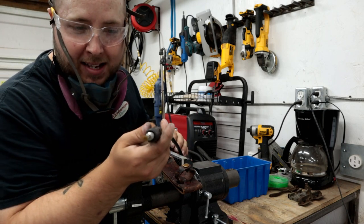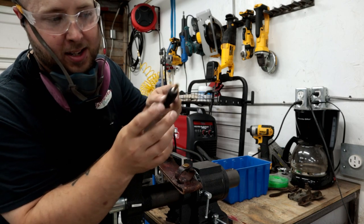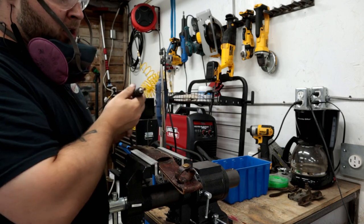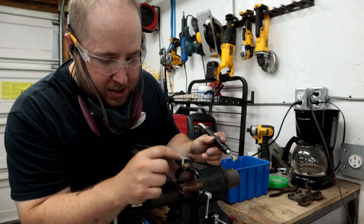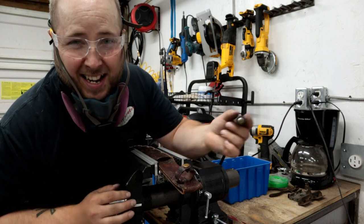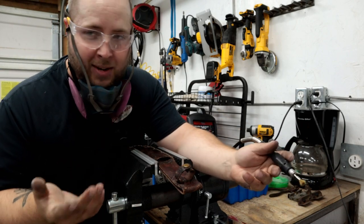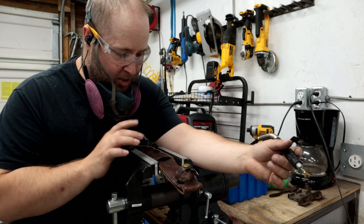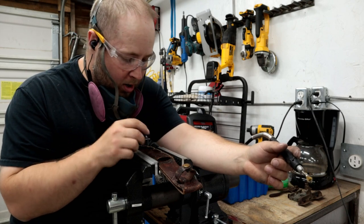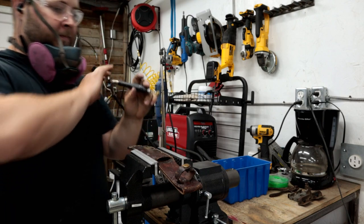We're going to use a little brass brush here. Again, that brass wire, nice and delicate. See, I can touch that. I'm going to go ahead and clean our little rivets and our brass snap and everything here, that's what tends to get really cruddy on these old sheaths. So leather, even just an oily, it looks great, nice and rich. But it's all the little crud and rust that gets in around those rivets. Just want to lightly clean them up.